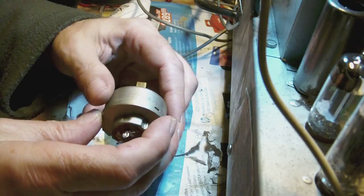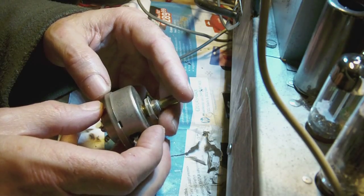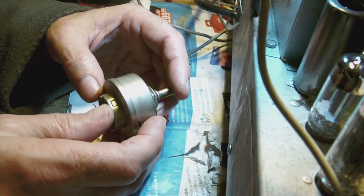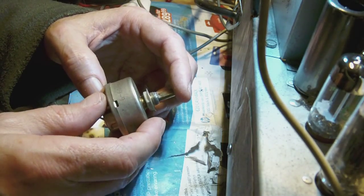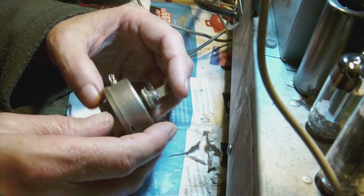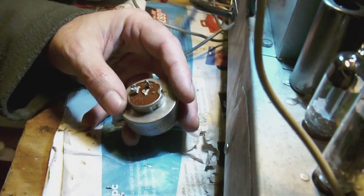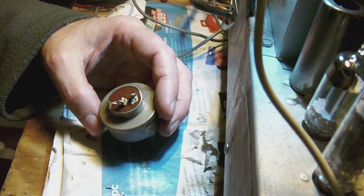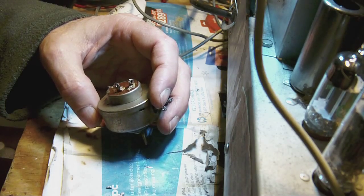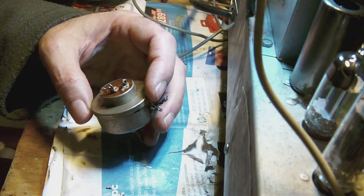Alright, so I managed to unmount the potentiometer, and it has a code engraved on it. I would say it's 137308. I don't know what that code is. Then there's a parts number code C737809-9. So I guess these are parts codes that RCA used. Also on the switch there's a little text which says it's a 3 amp 120 volts or a 1 amp 250 volts switch, and the usual patent text you see on those parts.